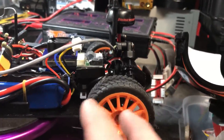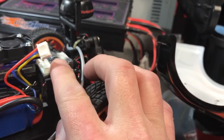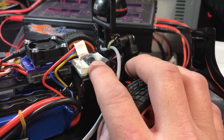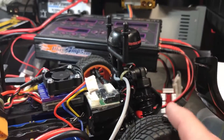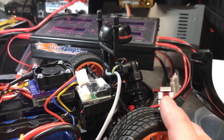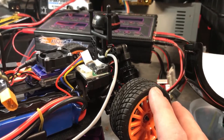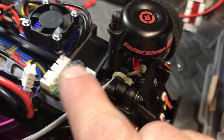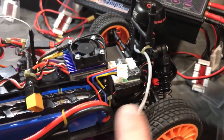How I power it is that the system comes with this voltage regulator and filter to filter out noise — electronic noise — so the picture is not static-y as much as possible. And that just fits that balanced lead. You can actually use a 2, 3, or 4S. I'm using 3S, and so I just kind of mounted it there.